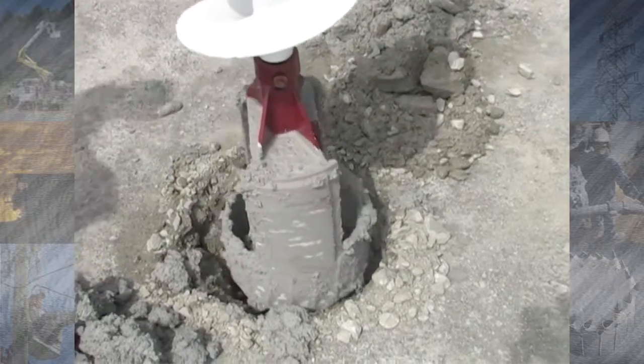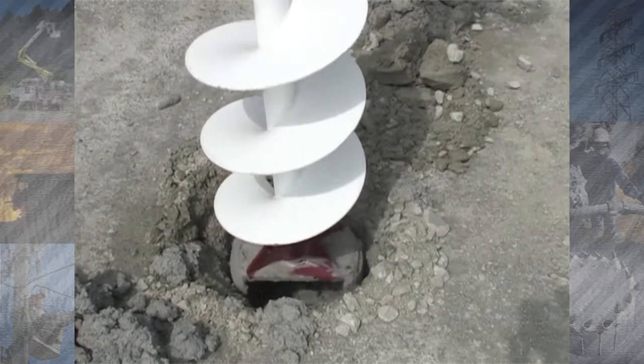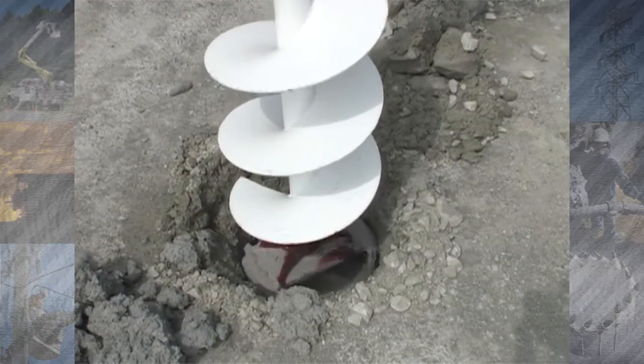You're using a lot more equipment with your jackhammers, air compressors, hoses, gasoline, keeping your air compressors running and everything. It's just a matter of bringing your auger with you and a pin, putting it on your Kelly bar, and drilling your hole.